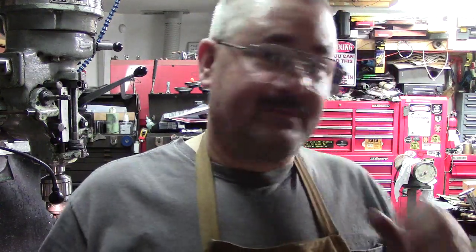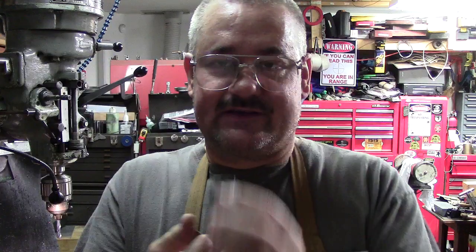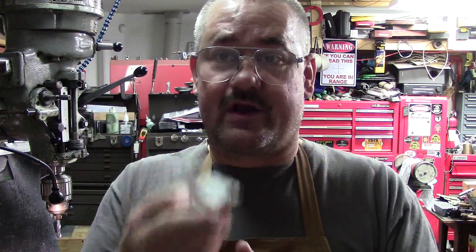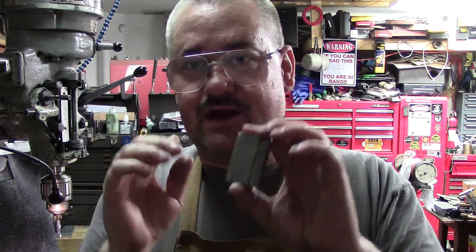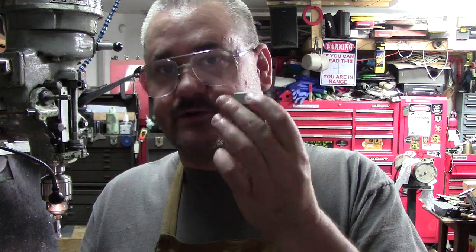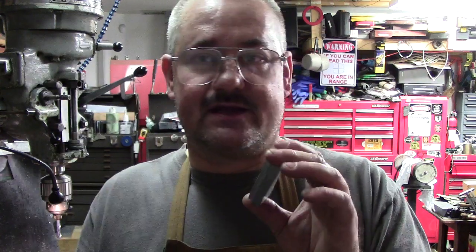Now I went to the metal store after I had started this project because I had to pick up some metal for other stuff. I did pick up some material that was not as wide, pretty close, an inch and a half. This is 1 inch, 440 thou, so very little milling involved. So a lot more conducive, if you guys want some of these. Say you have the Logan lathe, or you need a T-nut built, holler at me, because I bought a stick of this material that's cold roll 1018, and I can harden it. Hit me up, my public email address, eagledustoff37@gmail.com. Very inexpensive.